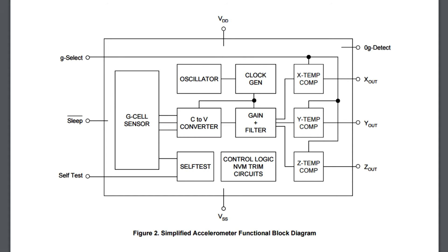Here's another accelerometer made by Freescale — the MMA7361. It's a much simpler accelerometer than the one on the discovery board, and would be a good option to interface to the Arduino Nano. It doesn't have an I2C or SPI bus; you simply have three voltage outputs for X, Y, and Z, plus a dedicated zero-G detect pin for freefall. You could feed that into a GPIO pin of the Arduino Nano for freefall detection — a simpler interface option.